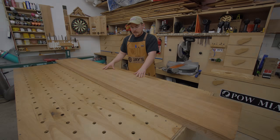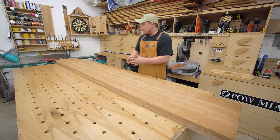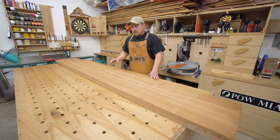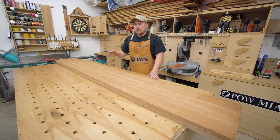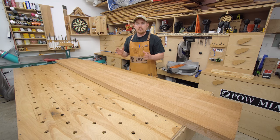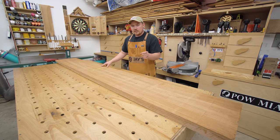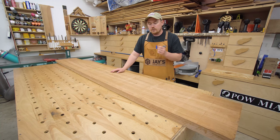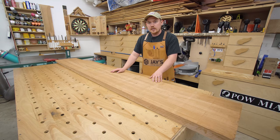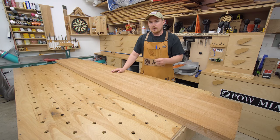This is the largest piece of lumber from our batch — 8-quarters thick, meaning two inches, fifteen and a half inches wide, and about eight and a half feet long. This is plenty of material for all the leg pieces for the lower cabinets and the corner pieces for the upper cabinets. All those pieces are the same shape, so layout will be easy. But we need to pay attention to the wood grain — we need rift-sawn material, not plain-sawn or quarter-sawn.